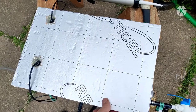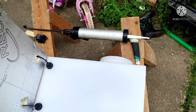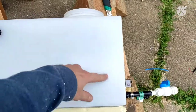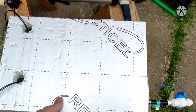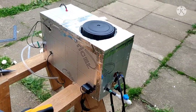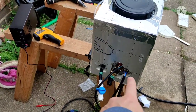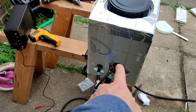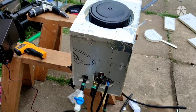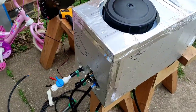To insulate the tank, I'm cutting out these pieces, drilling holes for clearances, and then using just some grab adhesive on the side of the tank to hold them in place. When I've finished it, I'll go round all the sides with aluminium foil tape. Here is the completed hot water tank. I've connected up a couple of electrical wires to the heating element and the fill solenoid just to test them, although I'm not sure my heater is actually drawing anywhere near the power it's supposed to — but we'll have a look at that in the future.